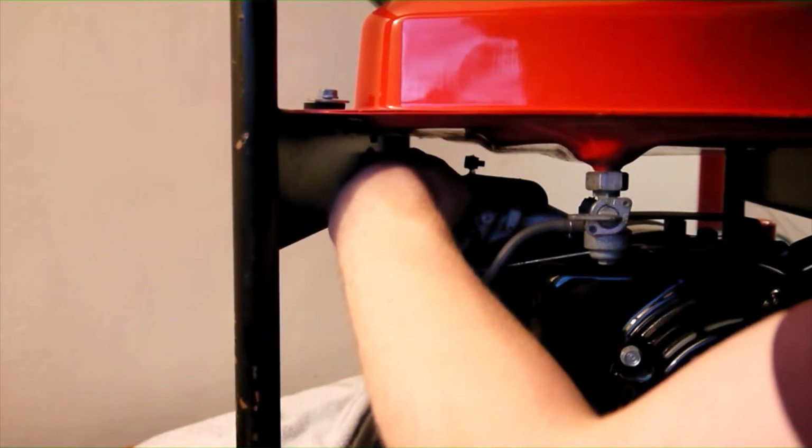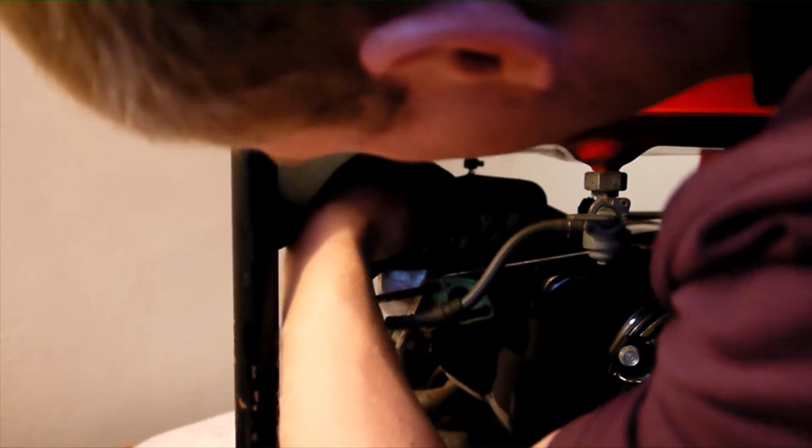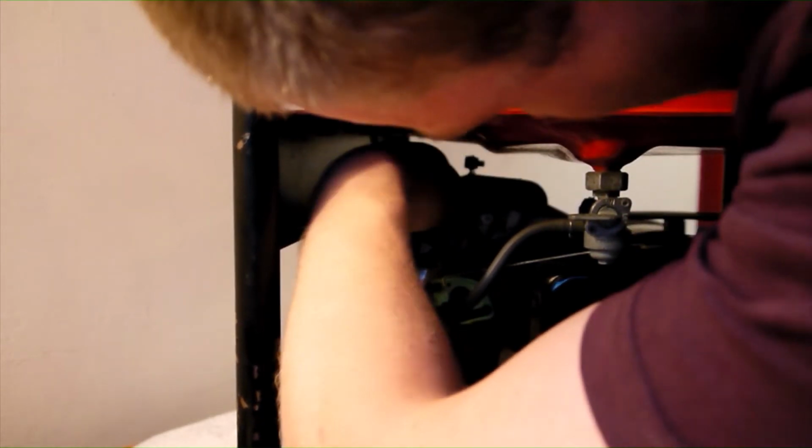As the spark plug is located deep in the engine and access is severely limited, I find it easiest to first insert the spark plug into the spark plug socket and then attempt to thread it into the engine, using the socket as an additional grip and leverage to my advantage. Take care not to cross-thread the spark plug. It should easily thread itself into the engine without much resistance, providing it is lined up correctly. Take your time over this step, as the cylinder head can easily be damaged due to it only being made from aluminium.